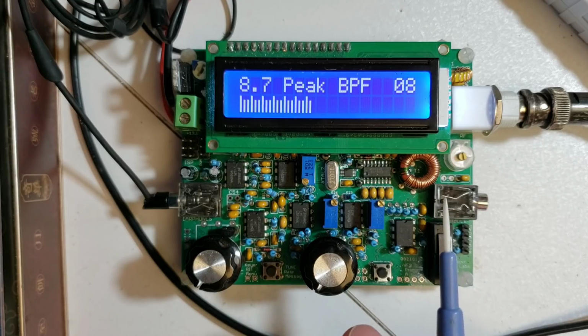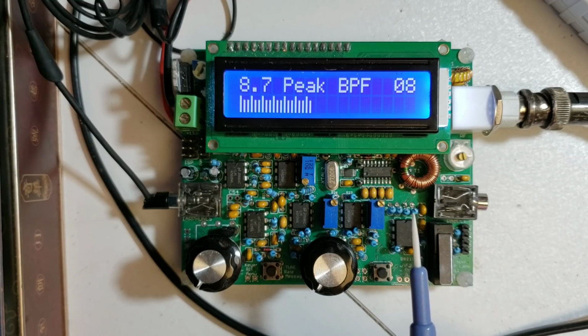Finding them is the trick, and the trick to this is being very methodical as you move through the signal chain. Nearly always the problems are due to soldering or incorrect component placement. It's very rare that there's an actual broken component.